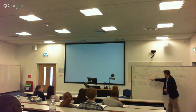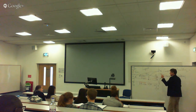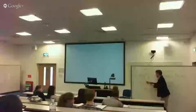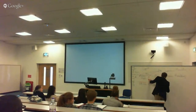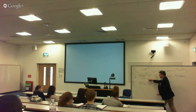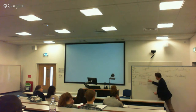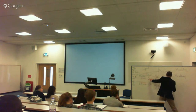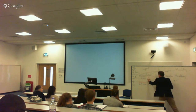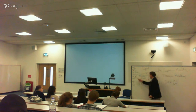Now, if you want to know how much beta you have, how much alpha you have, use the lever rule. For example, the percentage of alpha is this bit, that is why I said you might think of a seesaw. Not that bit, this bit, the opposite bit, i.e. XT, the length of XT, divided by the total length, right?